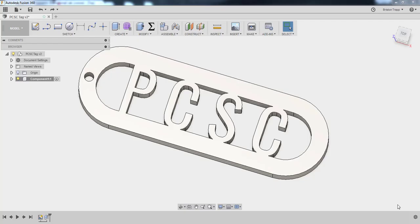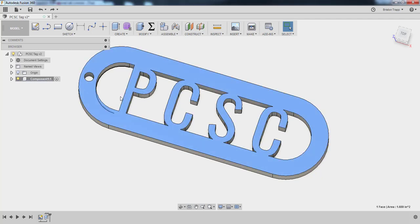In this video, I will show you how to program in Fusion 360 for the OMAX ProtoMAX Waterjet cutter. Check and make sure we have our 3D solid model. It doesn't have to be the exact thickness that you're actually going to cut your part out. That really doesn't matter. That's taken care of on the machine out in the shop as far as the material thickness and how long it takes to cut that thicker material. But we do want to make sure that our part is one solid piece.